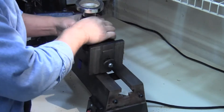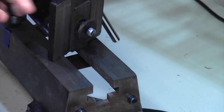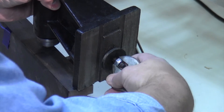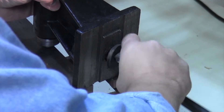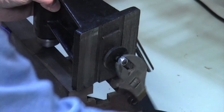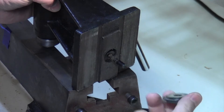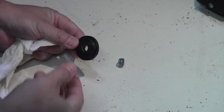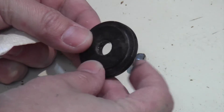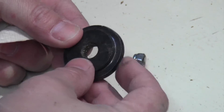So I'll go ahead and remove the tailstock and take a look at that plate. The nice thing about having a round locking plate is that you don't have to line it up when you take off and replace the tailstock on the lathe — it lines up pretty easily. So whatever solution I come up with, I want to keep that feature. Here's the edge that makes contact with the underside of the lathe bed — there's just hardly any surface there at all, maybe three sixteenths of an inch or about five millimeters.